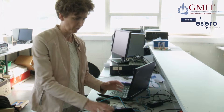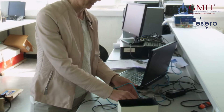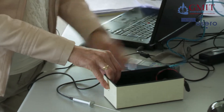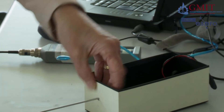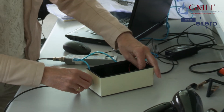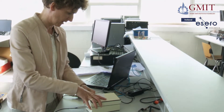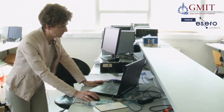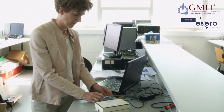In order to reduce fluctuations in temperature caused by drafts and air currents, I decided to put everything into a little box. So I have a little cardboard box here. I'm going to put in the Arduino. You could use it with the radio transmitter if you like, instead of the cable. And here I have my thermometer. I just made a small hole in the box to insert that probe, with the probe positioned in the air very close to the thermistor. Then I'll get the lid on and open up the serial window so I can see the temperature readings.